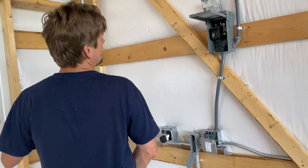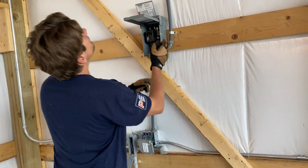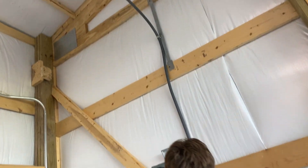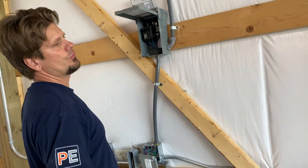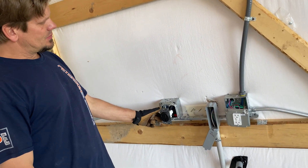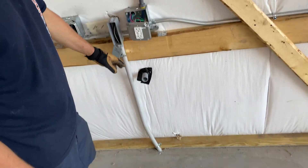I also have a two-pole GFCI circuit here. This is a space heater - it's got a remote. You do have to have a disconnect within sight, and it has to be GFI'd at 240-volt now as of this year. We also have a welder plug at 50-amp, and that has to be GFCI'd as well. We also have our wire that we pushed through our concrete down there.